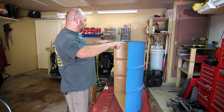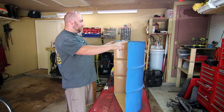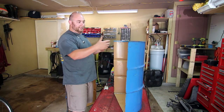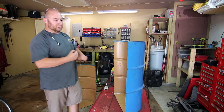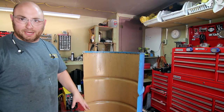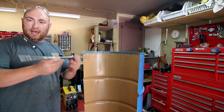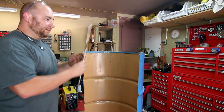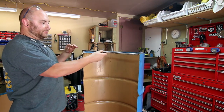Now that it's cut, it's a little flimsy for my taste. What we're going to do is put a small piece of metal — a rod or whatever I've got in the scrap pile — to basically connect the two open ends, because this part already has a bottom on it, so it's kind of a lidless bucket. We measured the inside of the bottom and it came out to exactly 22 and a half inches. I had some free tube stock, cut it to 22 and a half inches, ground the area off, and I'm going to weld this flat right here and then force it tight.